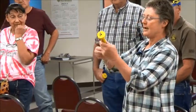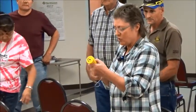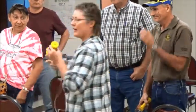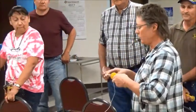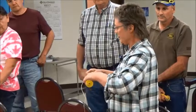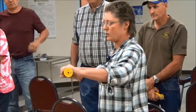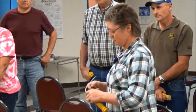Now you want to leave a little tiny tail on it, because sometimes you go, uh-oh, your fence is too tight, so you need just a little bit more twine, or the fence breaks and you need a little bit more twine, but you don't want it too long. And what will happen to you when you get zapped by that loose tail? You are angry. So you don't want to do it. So what do you do? You take the time to twist the twine. And you twist it, twist, twist, twist. And this is a little too long because you've got to twist for too long. But you twist it up nice and tight, and then you don't get zapped by the hot tail on the end when you unhook your fence in a big hurry. Take the time to twist the twine. Never cut a knot in the twine. Go ahead, you will.